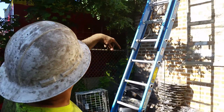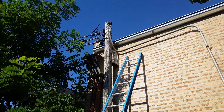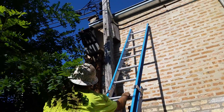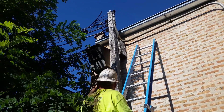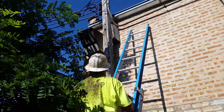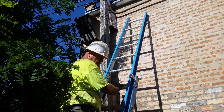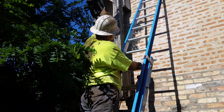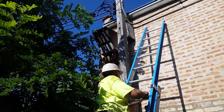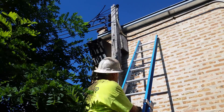I've cut the power off here just to make it more manageable. This wooden post right here that the service head is attached to - it's about to come off. So we're going to rip all this down and build a new one. That 100 amp has to stay so we can keep our temporary power, so I'm just going to build another one right next to it.